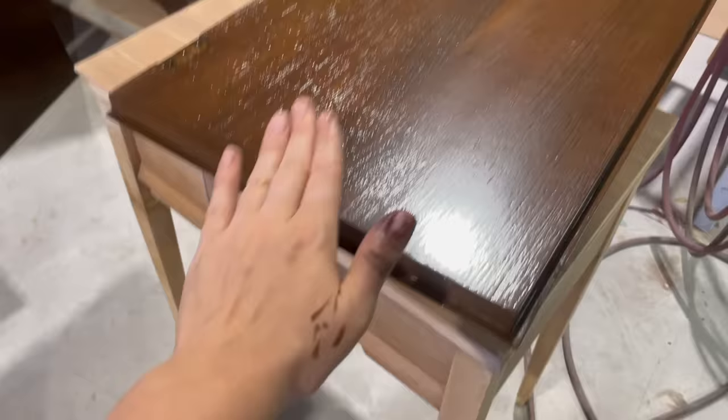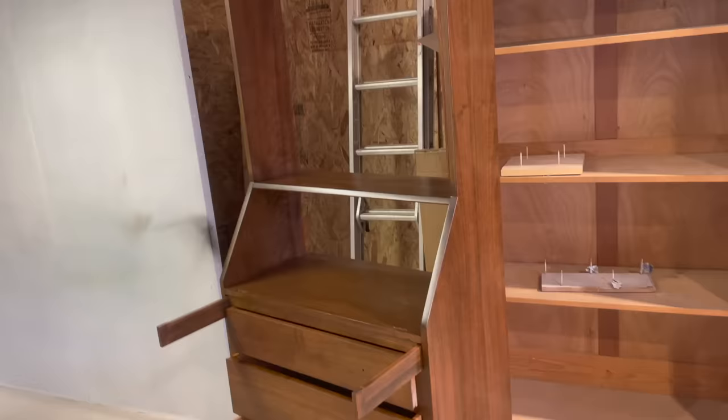So these guys, I just gave a little squirt. They're fine. And the lid here, or the drop down, has the finish coat on the inside, and I haven't done anything on this side yet. So I might do that tomorrow and just let that dry. Back panels are finished. Shelves are done. Cubby holes are all sprayed and tinted, so those look good. So what I'm going to do right now is just put a third coat on the general cabinet here, and hopefully we are done with the cabinet itself. So I've sealed all the drawers inside as well. Might do another sealer coat before I do the whole thing.